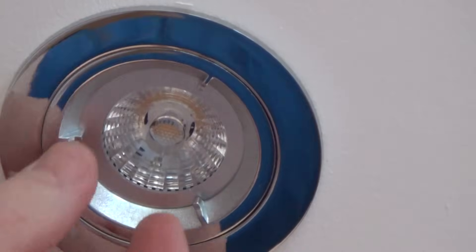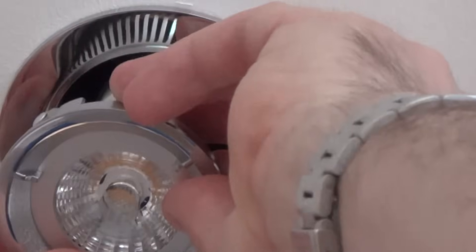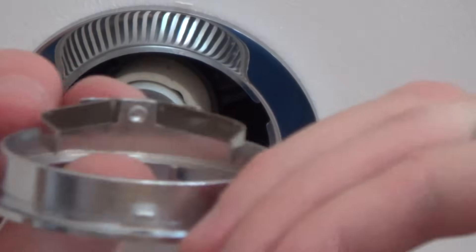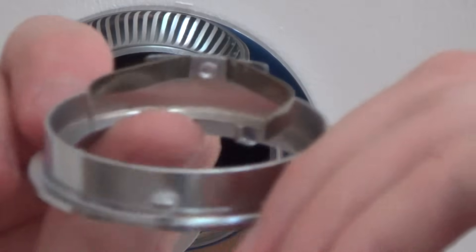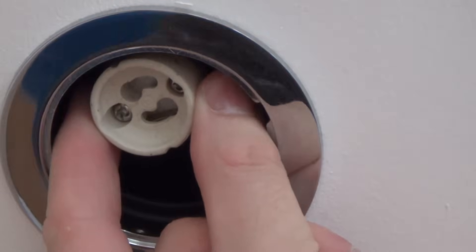With this one, you've got these little bits on it and there are three little tabs — you just twist them and when you twist them, it will drop down. You can then see there's a little clip here where the halogen or LED clips in. Just like the kitchen one, you hold the base unit and twist it anti-clockwise and it will drop out.